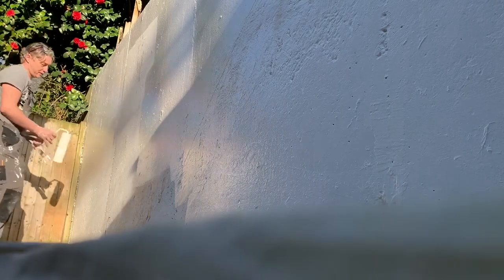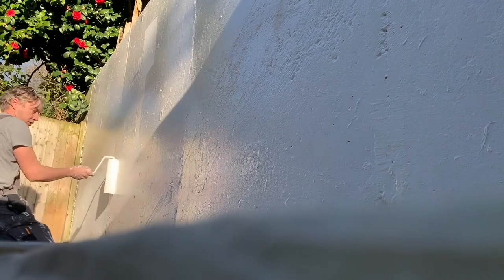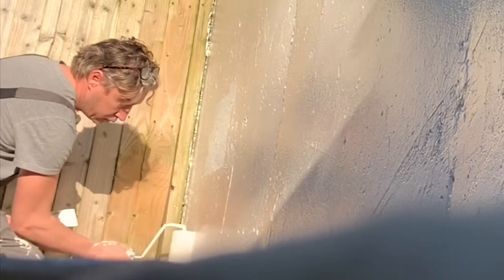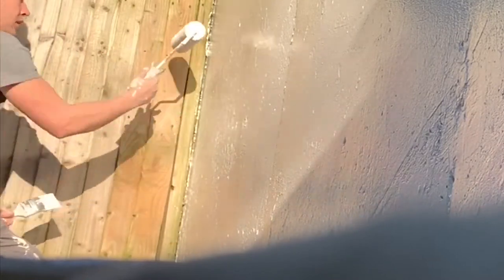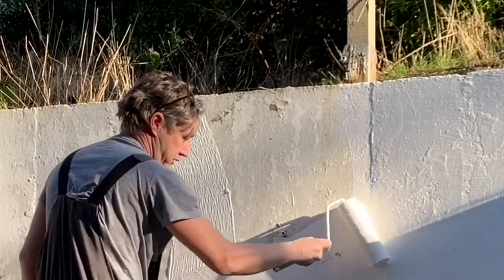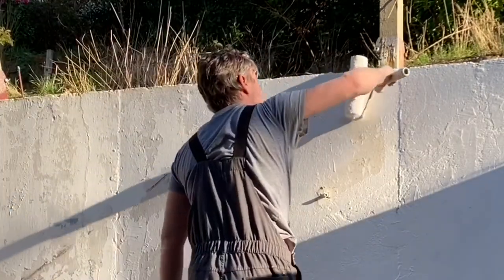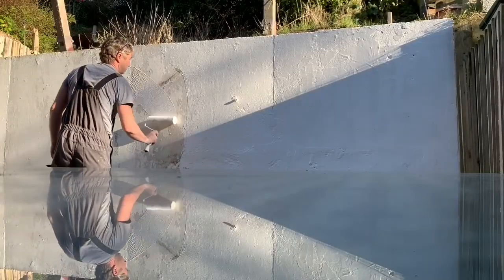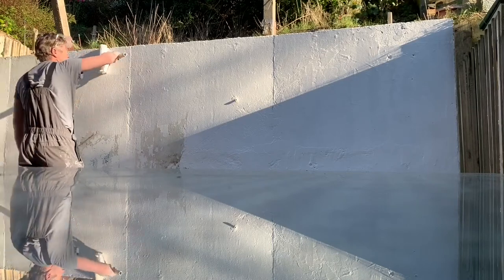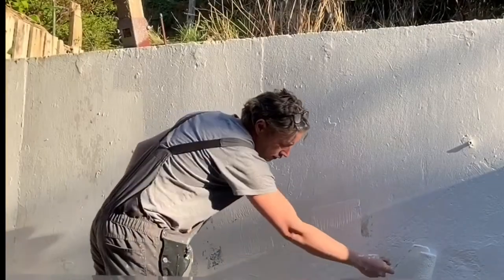Getting down to that bottom left-hand corner now. Started off on the right, rolled the top, rolled down to the bottom, done a little bit and then moved on to the top and bottom of the left-hand side. You'll find I've missed out most of the centre — I'll come back to that. It just makes for a more even consistent coat. You can see the left and right-hand side blending in together. It looks a little clumsy — a big slop of paint on the wall — but you move through it and spread it around. You can keep going back to a tray getting a little bit of paint on the roller, or I prefer to make a reservoir on the wall: take a well-loaded roller, dump it on the wall and then spread it around from there. It's much quicker, and as long as you're careful to check that you've moved your reservoirs and not just left them hanging there, you end up with a nice smooth even consistent coating.